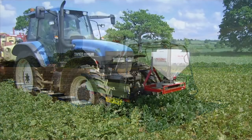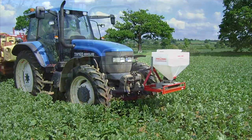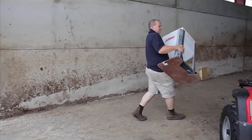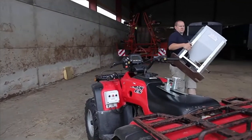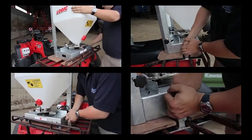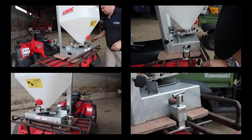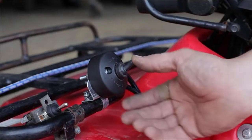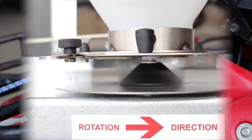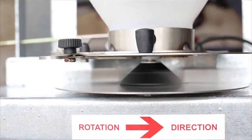The 130 litre model is designed for working on utility vehicles, large tractors and implements, or specialist machinery such as a self-propelled sprayer. The ATV mount kit with brackets allows the broadcaster to quickly and simply be fixed to the ATV, with each of the two clamps securely holding the wooden base to the ATV rear carrier. The 12 volt electric power is supplied by the optional Logic A500 wiring harness, which incorporates an on-off switch that can be mounted onto the ATV handlebars. Once the switch is turned on, the disc motor powers the disc to full speed, ready for the hopper contents to be spread.